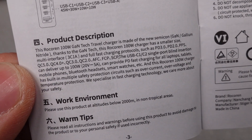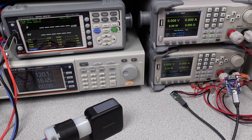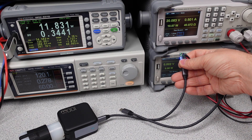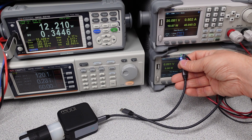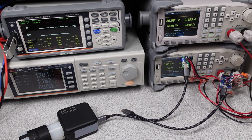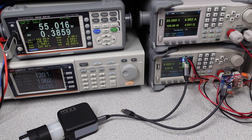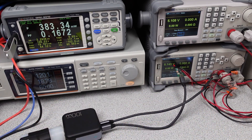The first thing I see with this power adapter is that it has reasonably low idle power consumption, right in line with other power adapters around this power level. The modes of operation are 5, 9, 12, 15, and 20V fixed USB 3.1 power delivery modes on the USB-C ports. The power adapter also has a programmable power supply mode of 11V, which can go to 4A, so this is borderline for Samsung's super-fast charging. The power negotiation is the same as most USB power adapters — any plug or unplug causes a renegotiation of all the outputs. The data on this one is kinda not great.